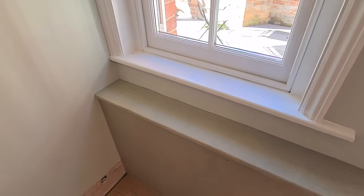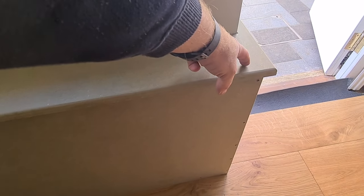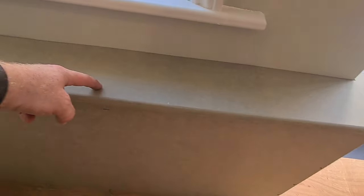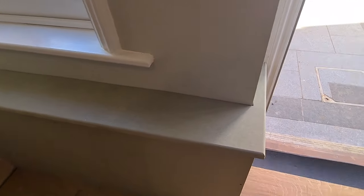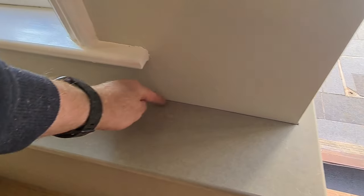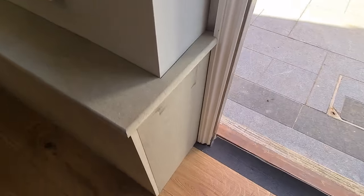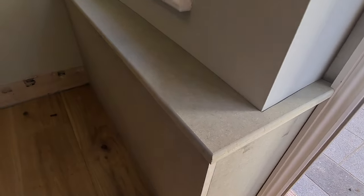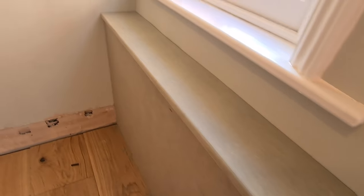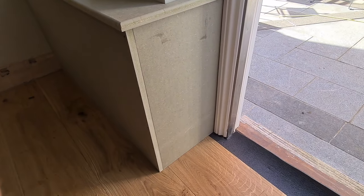this is being removed in a few weeks' time for a water softener, but all we'd do from this point is just go through the top here into that bottom piece of MDF, and then we go through the top of the back here just to tie it into that batten that we fixed earlier. But as you can see, it's a nice neat job. And then we'll sand that all down and seal it, ready for it to be painted.